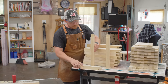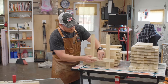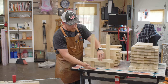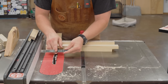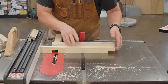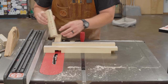I'm going to cut the easy one first. The lower rail — the distance from the top of the rail to the floor is four inches. That means I need the left side of my dado stack to be four inches from the fence. Then I can use the kerf-maker style stop block. I have the fence set four inches away from the outside of the dado stack. On my last cut it'll be up against the fence, and that'll establish the top of the rail to the ground. That's where the kerf-maker style stop block comes into play.